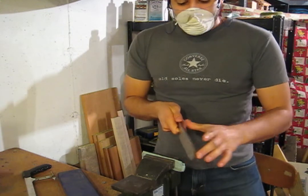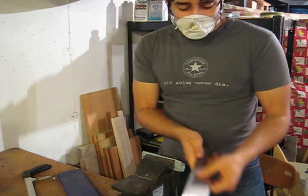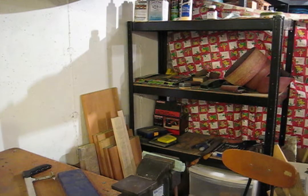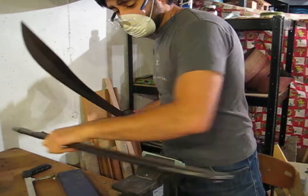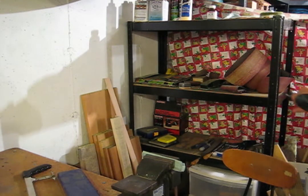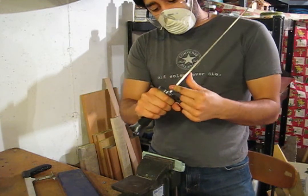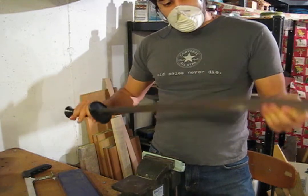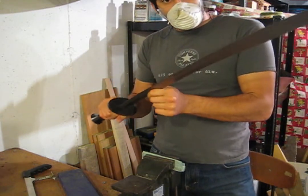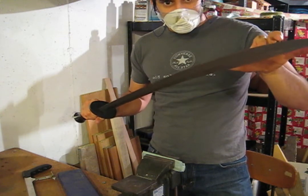The distal tapering is used to reduce weight on the end, and it's very important on longer knives and swords. If you have a long sword — like this Chinese broadsword — you can see that here at the base it's really thick, and up near the tip it's really thin. The metal at the base has to hold the weight of all the metal further up and bear the stresses from lever forces, because that distant metal has a lot more leverage.